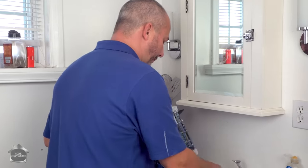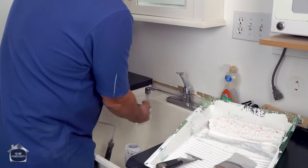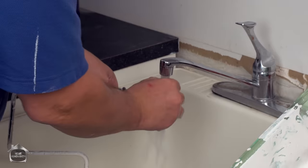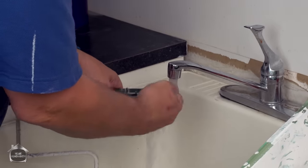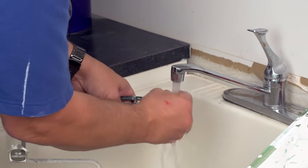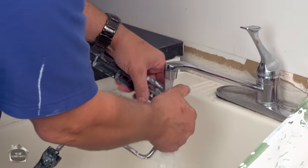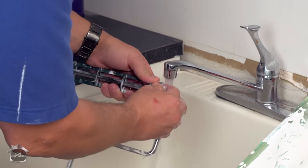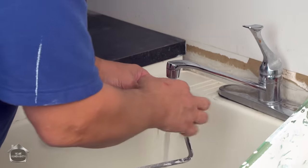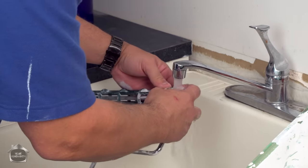So the first thing we're gonna do is we're gonna wash our roller cage, because we don't want mountains of paint building up on these, okay? Because then it gets really difficult to get the sleeves on and off. Very important that you get these 2 ends incredibly clean. All right. Now, I don't care if a little paint dries up inside the cage, but just make sure that the edges are all cleaned up.